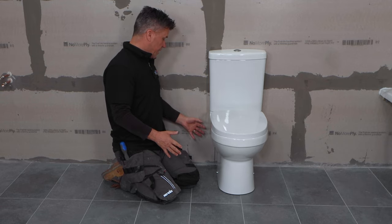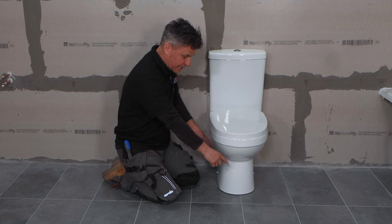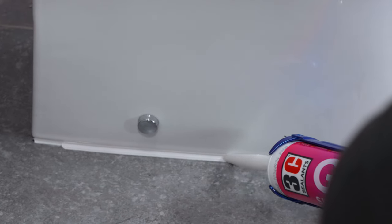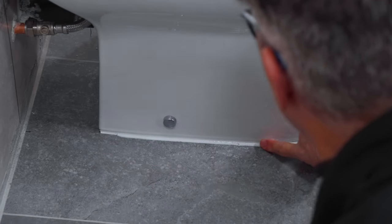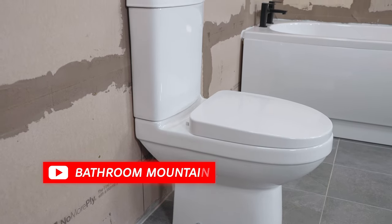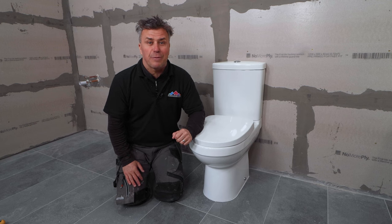Now you can turn the water pressure on, let the system fill up, and test that a couple of times to see that you're happy with it. I'm going to leave the adhesive to dry overnight and come back tomorrow to do a nice clean line of silicone around the bottom base of the toilet. To finish the bottom of the toilet off, I'm applying a nice clean white line of waterproof silicone all the way around the base of the pan where it meets the tiles, and then you can smooth this off with your finger. That's how you fit and plumb an entire toilet system. If you're looking for more videos, don't forget to subscribe to the YouTube channel and keep in touch on social media. For the vast range of products that Bathroom Mountain stock, head over to their website: BathroomMountain.co.uk.